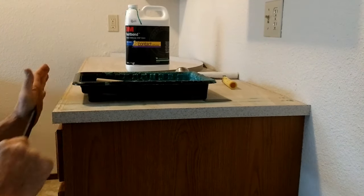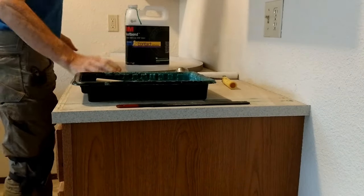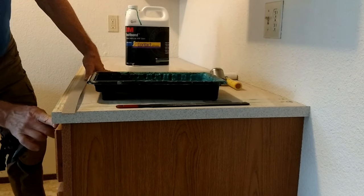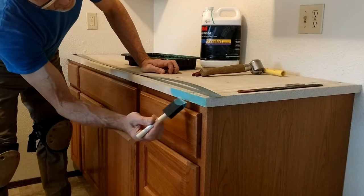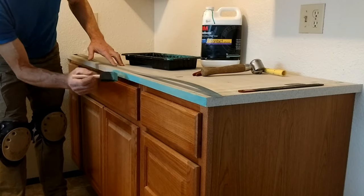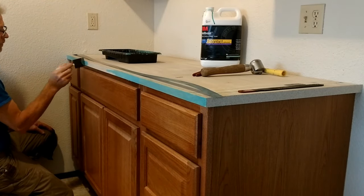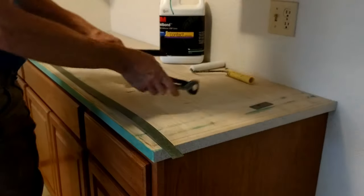Take the file and dress up the end and we're back in action. Now we're going to glue the front self edge on — I've already fitted it to the wall. Start spreading adhesive. Our corners are our most vulnerable part of the countertop, so make sure you get a good spread of adhesive there, as they're most likely to get bumped and ends knocked off. Make sure you get a nice even spread, and if you get a build-up along the top edge just brush it off.